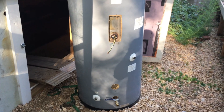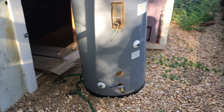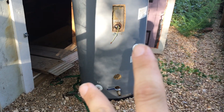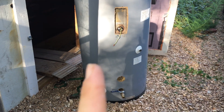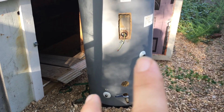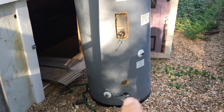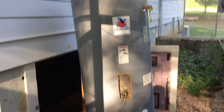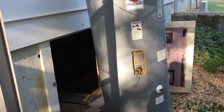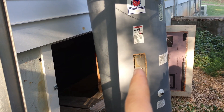Stepping back to show you the tank before it goes in the crawl space, because it'll be dark in there. It's got a wraparound stainless steel heat exchanger — a coil that wraps around — so if I ever want to do solar hot water, I've got that capability. There's the port for flushing it out, a couple of temperature sensor ports, and the 4,500-watt element. The thermostat was removed but I'm putting it back in.